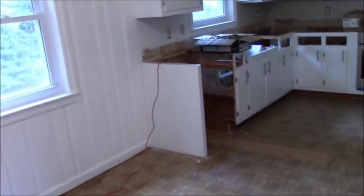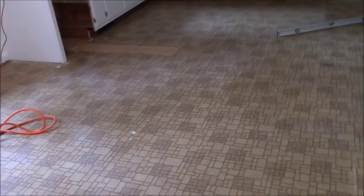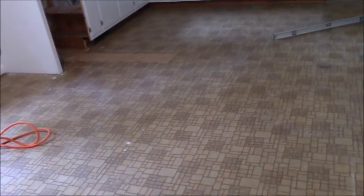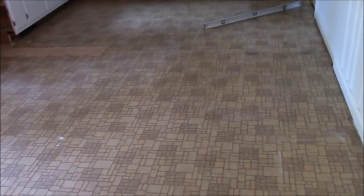This is one of the rare cases where I'm just doing the floor — no shower, no backsplash, nothing else. This is a dining room and kitchen combo, and the entire floor is almost 300 square feet — roughly 250 to 270 square feet of actual space. There's 300 square feet of tile ordered because there are cuts and waste, so you always want to bump up your number.